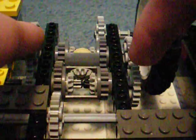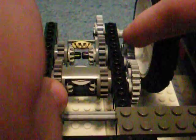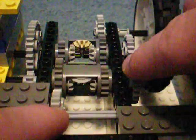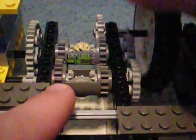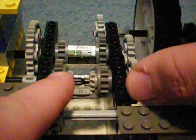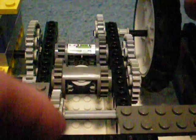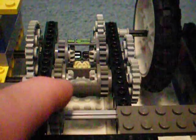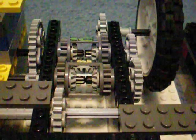So if we try to stop this side from turning, then only the right side will turn, and that gives a 1 to 1 ratio. But if we try to stop this side from turning, then it turns the left side, which is a 5 to 1 ratio. So while this is spinning from the engine, if we try to stop this shaft from turning with the wheel on it, then the right side will slow down until it comes to a stop, and only the left side will be turning, giving a 5 to 1 ratio. And since each side is able to turn simultaneously, even though at the extreme ends one will completely stop, it's able to switch from any ratio between 1 to 1 and 1 to 5.